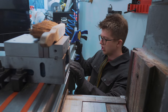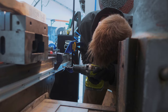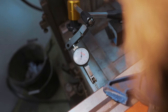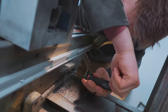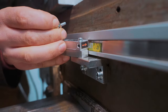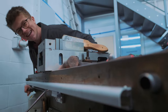We're going to start on the long axis of the machine. I've got our long extrusion sat atop parallels. We're going to line it up to the center of travel, then drill and tap a whole bunch of holes, and indicate it in to make sure it's straight. Let's indicate it in — this is a dial test indicator, and this will tell us if there's any deviation on the tip. It's looking pretty good. Now we install the bracket that holds the encoder. The magnetic strip, which has a little bit of stickiness on the back of it, gets inserted. Then we slide the stainless steel strip in. With a little shim of cardboard, the encoder goes on. Pull out the spacer, and hopefully the bad boy works. Yes! It does it. That's one down, two to go.